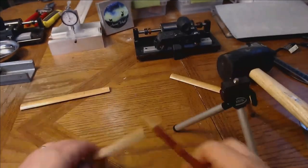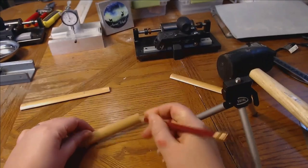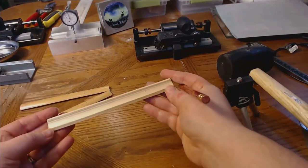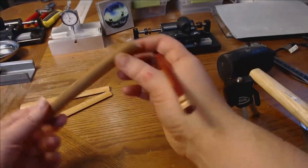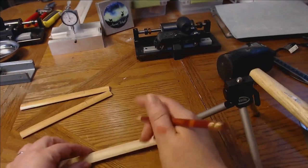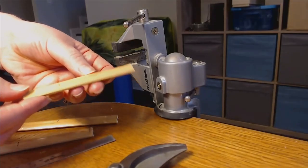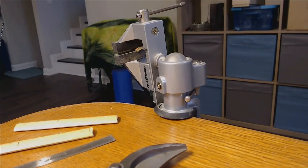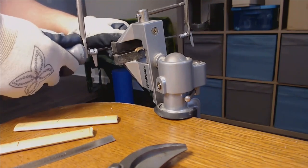What's wrong with this one? It's a little less flat at the top, so I'm just going to cut that part off. Depending on what kind of saw you use, you might have to identify either side — it's sometimes easier to cut through one side or the other. That end needs to be cut off as well. Here I'm going to trim off those unwanted segments with a coping saw with the piece of cane in a vise.